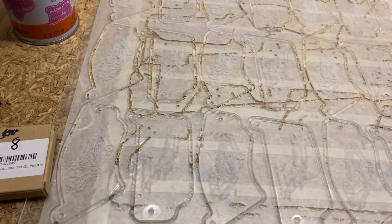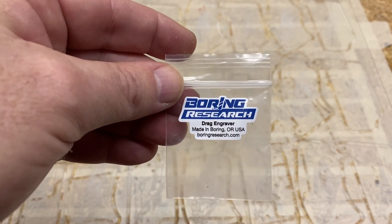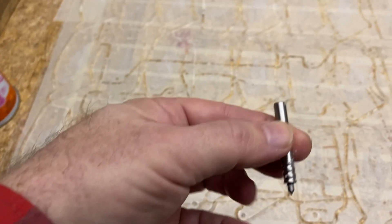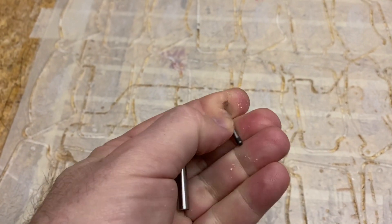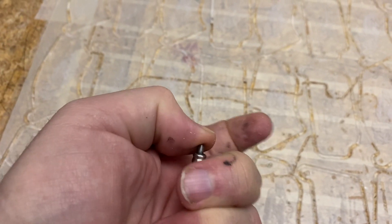My next step is to do the etchings, which I do with a diamond drag bit from Boring Research. I'll put links in the description so you can go straight to these. They have different spring strengths and different bits. I use the 90-degree bit with the heavier spring. The bits are really nice because they're held in by a magnet — you can pull out the bit and put it back in the shaft, and it snaps right in place with a spring that gives it some give.